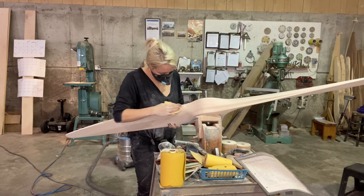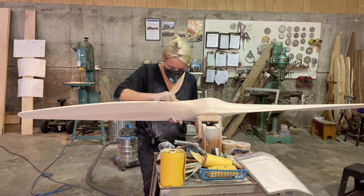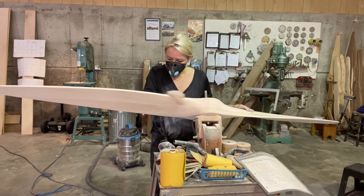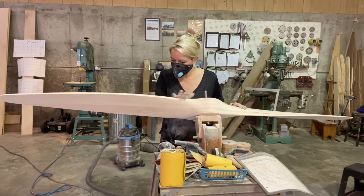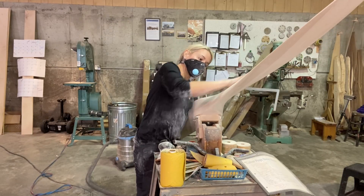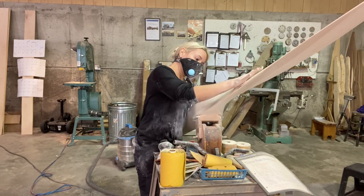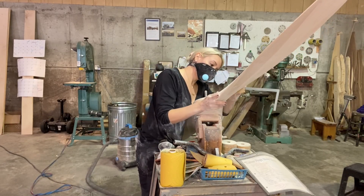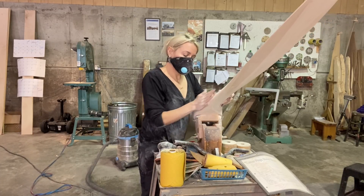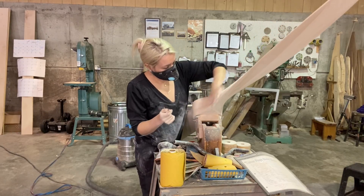What I'm doing here is a quick pass — I've already looked at which sides are my heavy sides, so I'm taking out any places that are a little rough. That spot I hit just there was a place I'd hit with the drum sander that I had to go back and smooth out. Your hub right through there carries a lot of swirls because as your grain changes you go almost from in-grain to smooth grain, and that will hold swirls in there that are a little more stubborn to get out than the swirls on the blade.